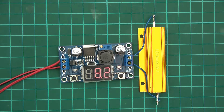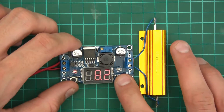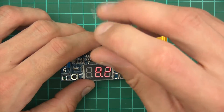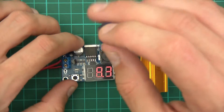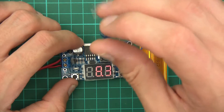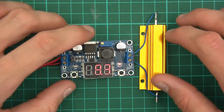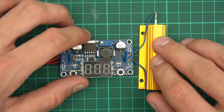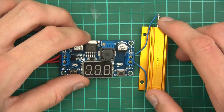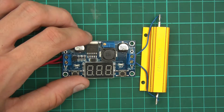It's drawing 400 milliamps — that doesn't actually sound right. Let's change this again. 8.2 — that's not right, and it doesn't seem to be coping very well. 8 volts, and it can't cope, and it's getting very hot, so I'm going to pull the plug. 8 volts divided by 8 ohms is 1 amp. Let's try something else.